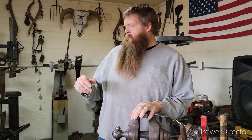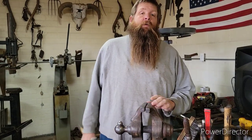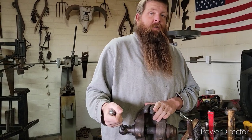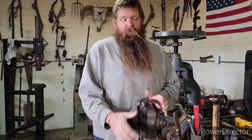I have several cast iron vices — some very old Apprentice and Bulldogs, some old machine-type vises. They're cast, they're awesome, they're very good, but they're not built for hammering. The impact and vibration will go into the case of those and you're going to wreck them. These leg vises are built for hammering in — not for hammering on, that's tool abuse. When your part is in here, just like your anvil, you can cinch down on these, they have a little bit of flex in the jaws.